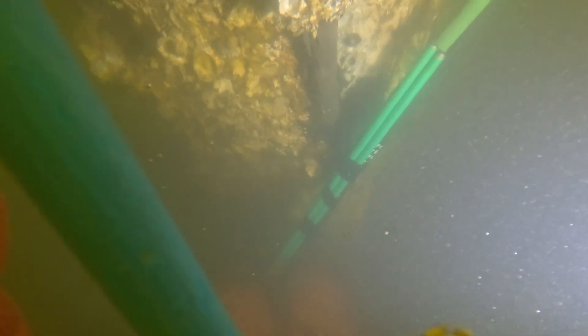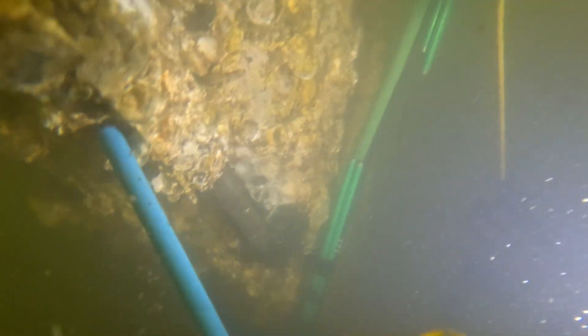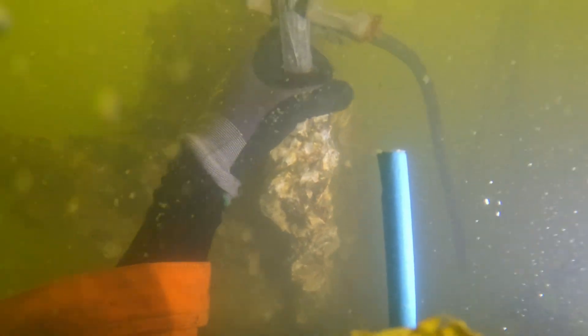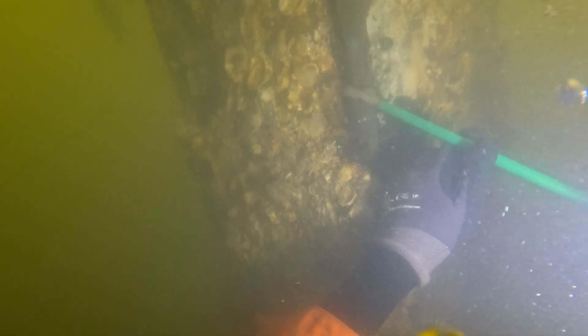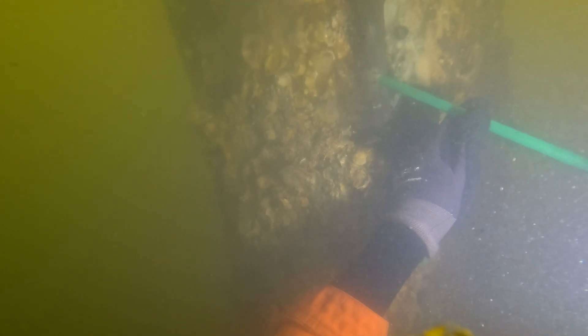The single black cable is our ground clamp, which is positive in this setup. The green hose taped to the other black cable is our oxygen line, and the negative lead goes to the end of the torch. Everything appears to be in order. I'm going to do a quick bubble test on the torch by pulling the trigger and making sure bubbles only come out the end of the rod and not where the rod meets the torch — and we're ready to start burning.